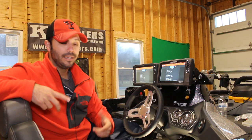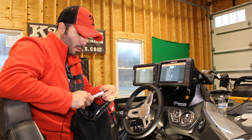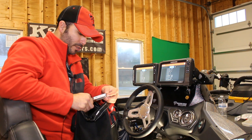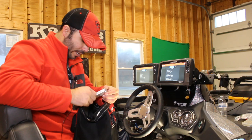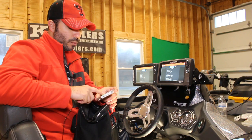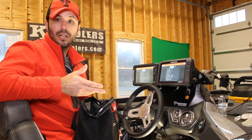Don't be afraid to take that panel off — just ease it out. Look for the connectors that are black and red and you'll be able to do it. You can also run to your switch panel and run one wire there. You can also run power from the battery, which is what I'm doing right now. I got some battery connectors from West Marine — nylon ring terminals rated for 22 to 18 gauge wire. The screw is 5/16ths, or 7.9 millimeters. That's what you need to connect directly to your battery. I just wanted to give you an idea of how to connect your power and how to troubleshoot the NMEA 2000, so that it could help you out.